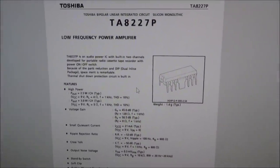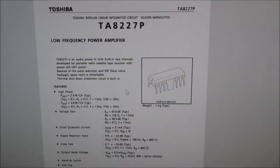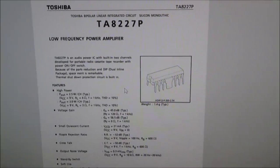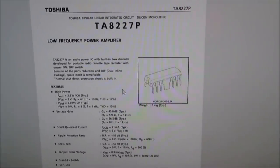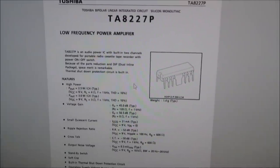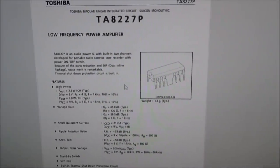It's kind of pointless fault finding something for ages if that chip is going to be faulty. And if you think about it, audio is not working on anything. The radio, the CD, I mean, I haven't checked the other things, I'm just taking Stuart's word for it that it's not going to work on the aux in or the Bluetooth. But I think all things point to this chip, so let's start here, swap it over, and see if that fixes the problem.